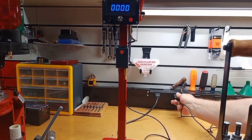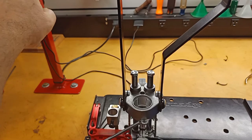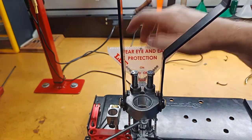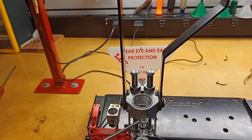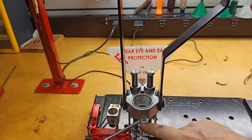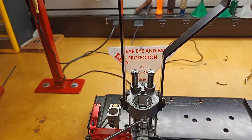Plug the power supply in and plug it into the control box. If our alarm is working — I turn this on — all right, we have our audible alarm! Let's feed it some primers and see if it turns it off. There we go. Now when I run below the point where the sensor is, I will have an audible alarm to let me know that the chute is running out of primers as I'm priming brass. It's very nice. I want to thank you guys for watching, I hope you enjoy it, and I'll see you later.